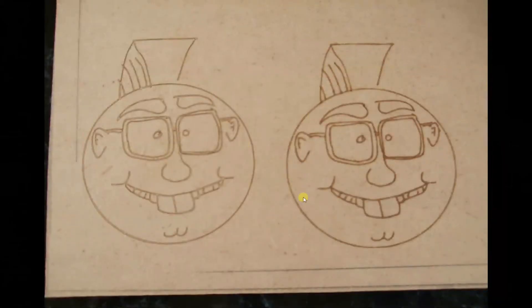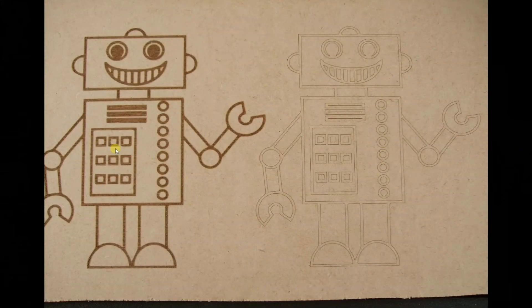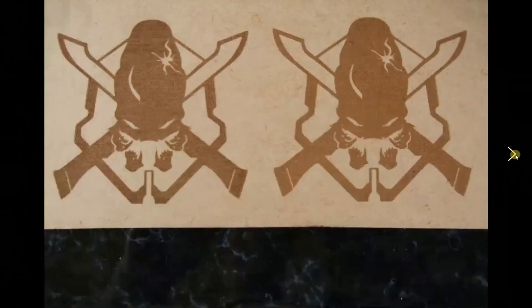These are some of the outcomes. We have laser cut and laser raster — different ways that we've told LaserBlazer 2 what to do, resulting in different outcomes. That one is laser cut and that's a raster. Different speeds and different powers give a different effect. This one is done from a grayscale image — the laser moves across at a set speed and automatically adjusts the power to create the tone.